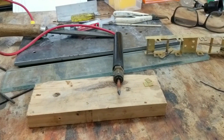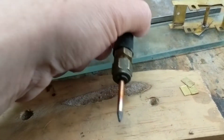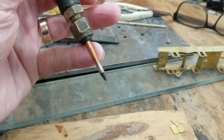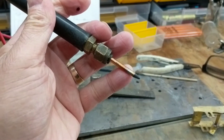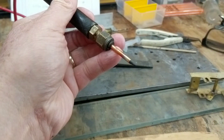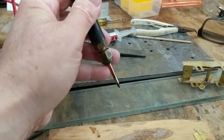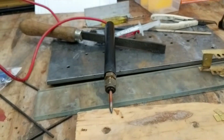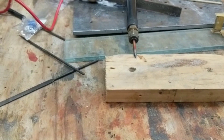But when you're soldering things like overlays, these are really good. The other reason is it doesn't get hot until you press the foot switch, and it works by resistance - a high current and resistance - because the carbon rod's got lots of resistance, and when you pass a current through a resistance, you get a voltage drop and it also generates a lot of heat, which is due to the electrons bumping into one another. That's a bit of theory, but enough said about that. So I thought I'd demonstrate it and show you what's inside.